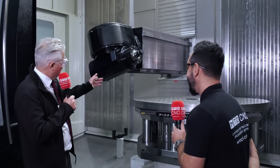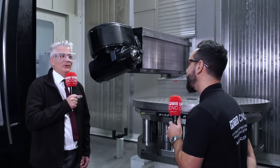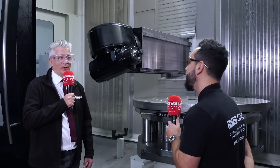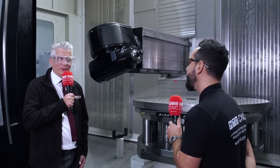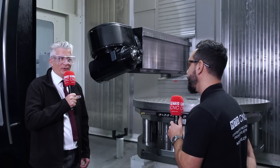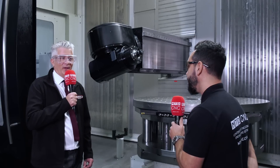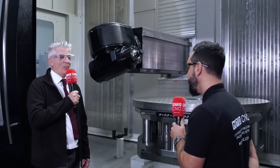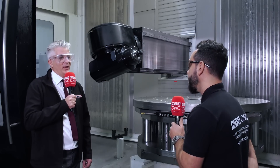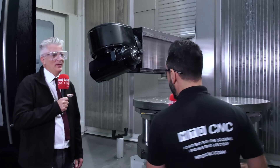The tool changer is hidden — just to the left there is a door. The ATC unit is mounted to the column, which was a specific customer request. Options included a tool changer on either side of the machine or attached to the column. Mounting it to the column means dragging that weight, which is all factored into the linear system and rack-and-pinion twin-motor system — giving no deflection and no backlash. The guard opens, the arm comes out, we change the head, and we have 80 tools available. We can change at any point without moving across the part, which is both accurate and quicker.